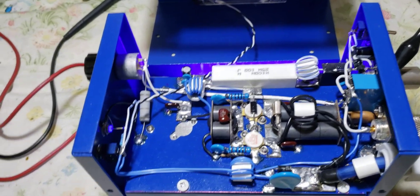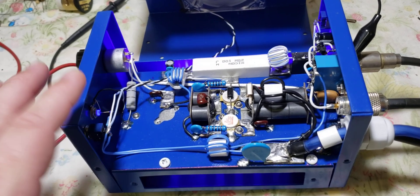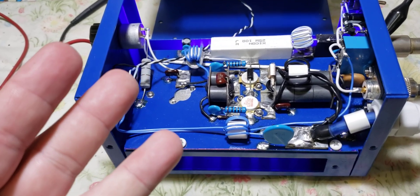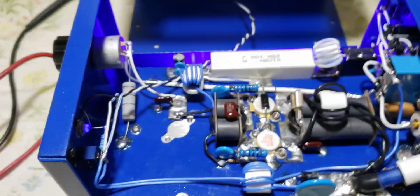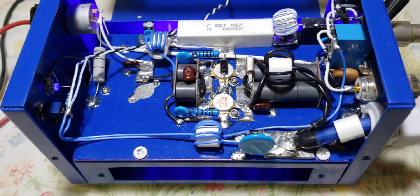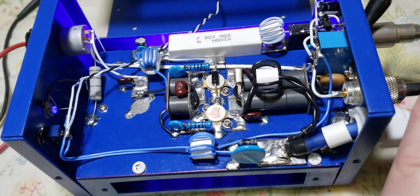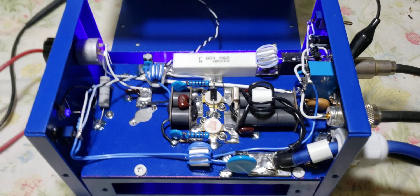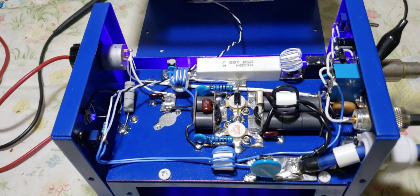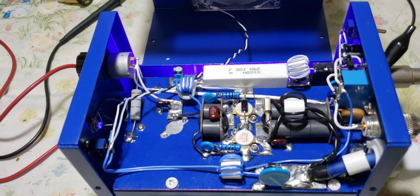That's all I'd drive in this box — if this box was mine, I'd hit it just like that. Beautiful driver. This box right here would be a beautiful driver for steel, for glass, for MOSFET, for other BJT boxes. If you've got a steel ceramic tube, thing's going to be biased — it's going to be in A-B bias mode. You've got a biased driver going into your biased box. If you're putting a class C into a biased box, it isn't going to be as clean sounding. That's why one of the most clean-sounding boxes you'll hear is Mr. Prime — watch some of his videos. He's biased — he's got clean, good, linear-sounding audio. That's what you want out there.